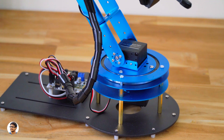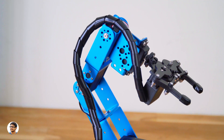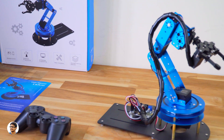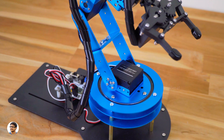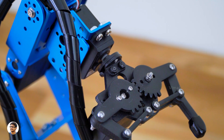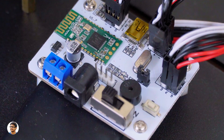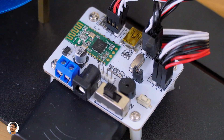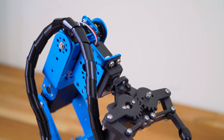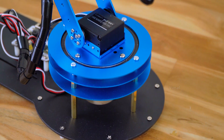Well, that was it for today. That was a complete look at this robotic arm from Layarm. It's a very fun project to do and you can learn a lot by doing such things. The build quality is pretty good, the arm offers 6 degrees of freedom, can be used to lift objects, and is also programmable with the PC software. But there are a few things the company could improve in their next model: the claw doesn't have any sensors to stop after holding an object and sometimes applies more pressure than needed, making the gear slip. Also, the joint between the claw and the metal frame is made of plastic, so I would not recommend lifting objects heavier than 250 grams — the company should have used a metal part instead. This robotic arm costs about $129, which is around 8800 rupees. It's a bit expensive but definitely a fun project. I'll leave a link in the description box below. I hope you all enjoyed the video — make sure to give it a thumbs up and subscribe to my channel for more awesome videos.